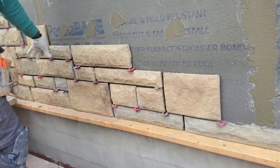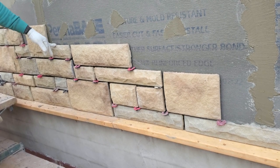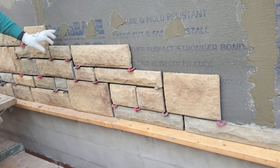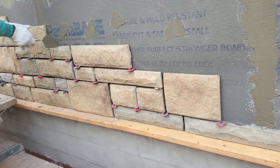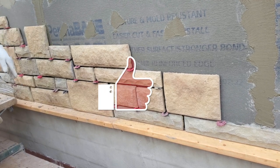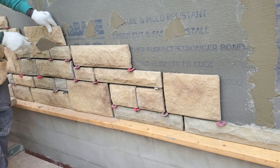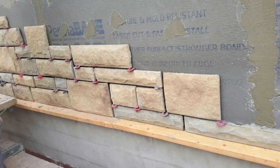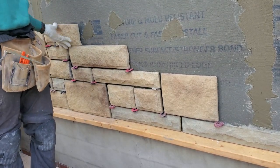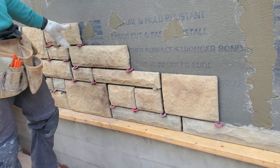Laying this stone guys is pretty simple. While you lay the big one it's already telling you clearly that you need to put a medium here — this height is calling for a medium. So what I'll do is put a medium right here, stopping around four inches away from this edge, and then continue from here on with small. Just going to cut it around four inches from the end here — put a small, then I want a medium one right here, squeeze them on.